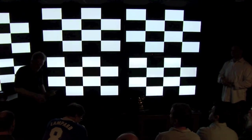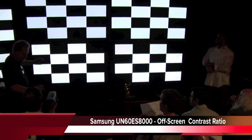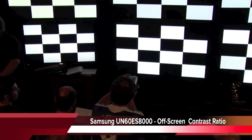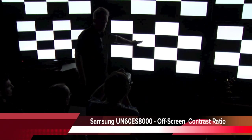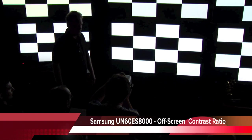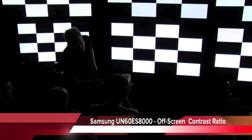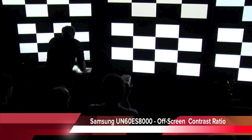Just for fun, what's your name again? Joe. Joe, I want you to do me a favor. Take the focus ring, look through the viewfinder, and focus on this white square in the center. You should be able to see every pixel pretty clearly. Try to hit near my finger and push the button once. Okay, once it beeps, we look over here: 33.57 foot-Lamberts. That's the peak light output of that box.